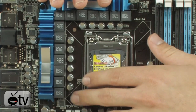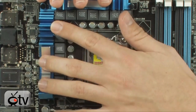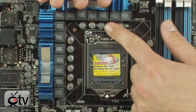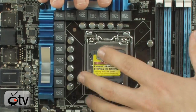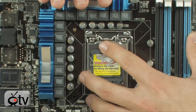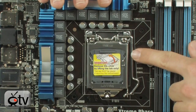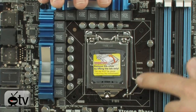The rest of the hardware is incredible: lower RDS(on) MOSFETs underneath very nice heat sinks, ferrite core chokes, and Japanese conductive polymer capacitors — all on board. The CPU socket also basically overclocks itself with the appropriate ASUS software: ASUS Auto Tuning, Turbo Key, or CPU Level Up will automatically overclock for you, or if you want full manual control, use Turbo V to do even better.